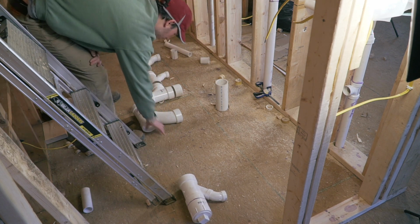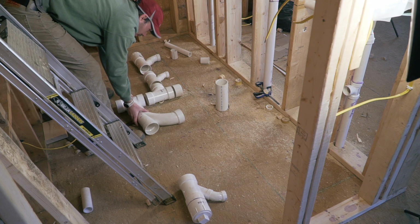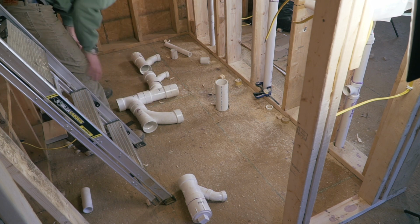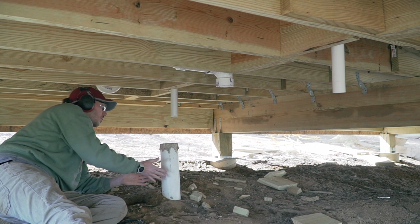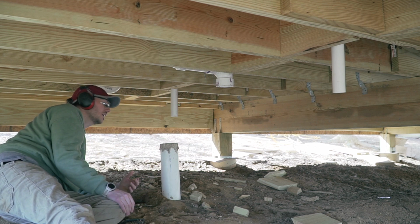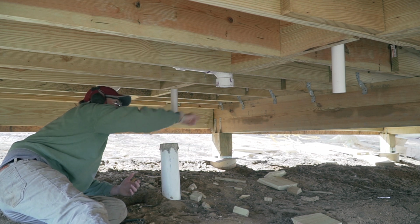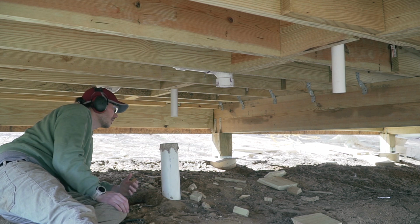And then obviously 3-inch pipe here, 3-inch, 3-inch, and then this guy like that. Man, if that's even possible. And then boom, and then we connect back to the sewer. It's fairly clear that, you see this guy, it's not going to work where it is. It's not even centered on the wall perfectly, because obviously I guesstimated it. So I think I'm going to have to somehow move it. It should be here, in between those two. I don't know how that's going to play out. I'm going to have to dig it out, but I think we'll worry about that later on.